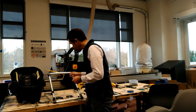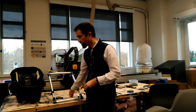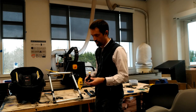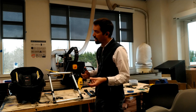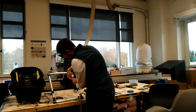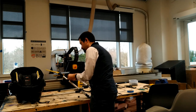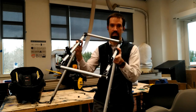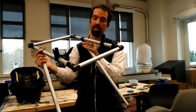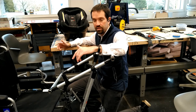Put the two Maker Pipe T-connector attachments on there loose, and then slide them to the proper position. Place the infant car seat into its cradle, then move and adjust the connectors. They need to be spread out just a little bit so they don't push the car seat up — make sure the car seat makes good contact. They can also be slid up and down so that the stroller connectors on the infant car seat butt up against them for extra support.